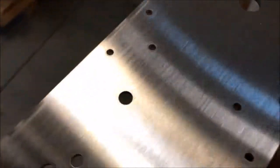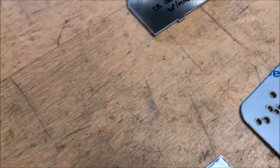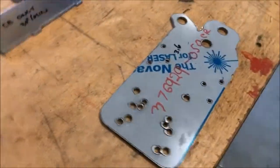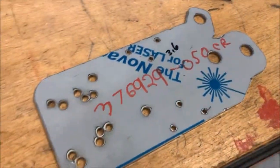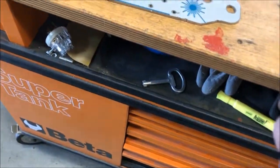The next part we are going to run is 3.2mm — I'm going to run this auto-parallel so you can see what that looks like. We will do the same thing with this part at 2.4mm. Then we're going to rotate them all around and run them with the PVC side facing up so you can see what that looks like coming out. You see a very nice surface finish with still a great edge.